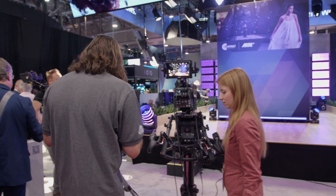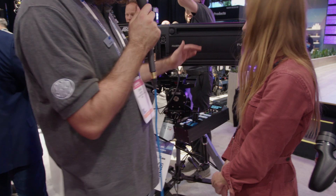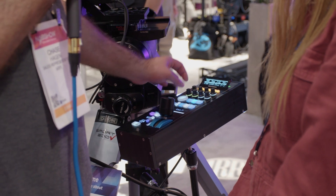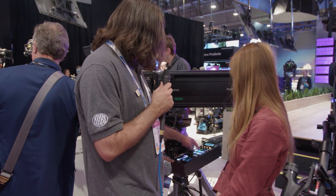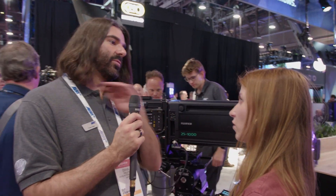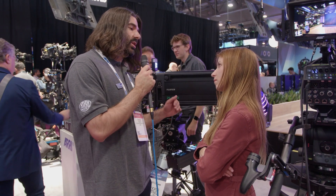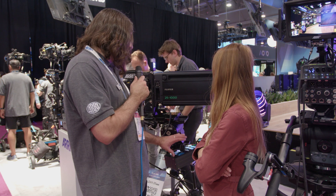And then what is the panel? So over here, this is called an RCP panel or an OCP panel — depends on what company you're coming from in broadcast. This is a control panel for the camera. For customers that want to control the camera remotely, this is a great interface where you've got all these hard controls, and you also have the ability to paint the camera or adjust the video parameters and color. What's unique about this panel is it's super customizable — they have little OLED screens on the buttons. You can say, hey, I don't like that button there, I want to move it here. In the web configurator, you can move every single knob and button and relabel them however you want. The panel can trigger record, start, stop. It can do playback in the camera, clip list, jog through a clip to fast-forward and play it back. You can load the camera setup, load different look files — what we call LUTs. You can do textures, change through the different Arri textures, in addition to just adjusting the video parameters. So it's a fully featured panel for control.